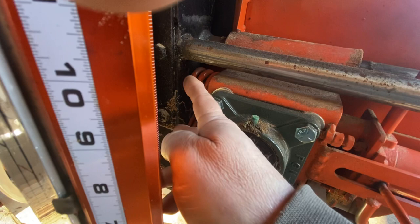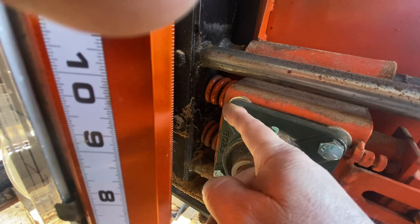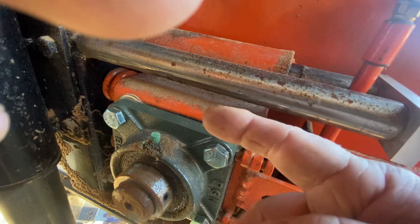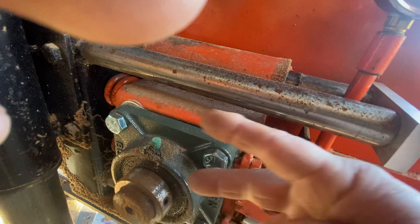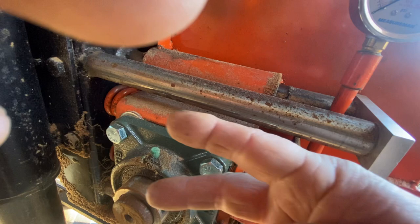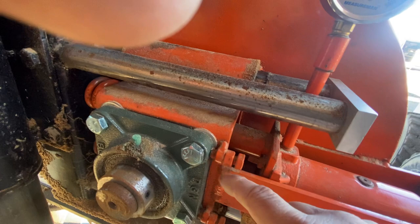These springs in the front — there are little nubs welded here top and bottom. The springs are approximately this long and are an 800 pound spring, about 3/8 diameter. These two springs just rest on top of those nubs to keep them from moving up and down. Inside there's a shaft at the top and bottom in the same location as the springs, but this shaft is separate from that nub. This shaft has a flange that was milled on the lathe — it's the diameter of the outside of the spring — so it touches the spring and they work in conjunction to keep tension on the springs, which pushes this whole mechanism with the bearings.